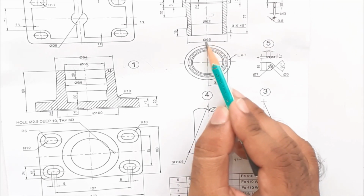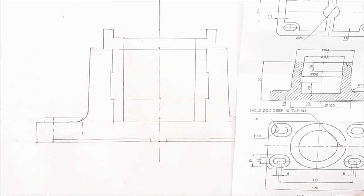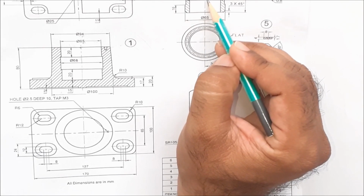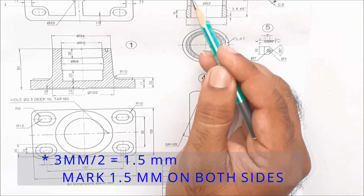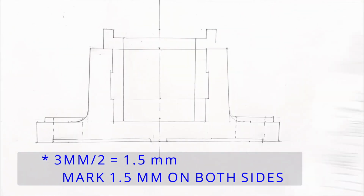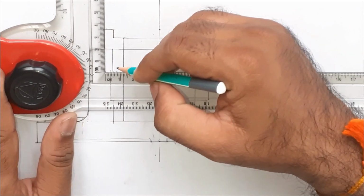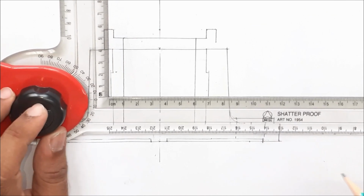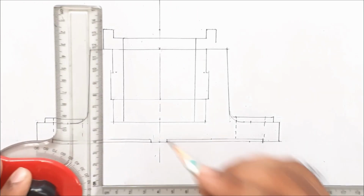Okay, it has the diameter of 65 mm. So we have already drawn this diameter of 65 mm. Then here we have got the diameter of 62 mm. So 65 minus 62 is, we'll get it as 3 mm. So we have to draw here 3 mm, and also we have to join this one. We have to mark here 1.5 mm. And here also 1.5 mm. Okay, so now let's draw this line